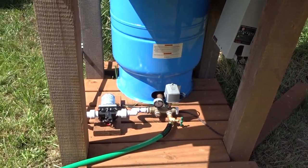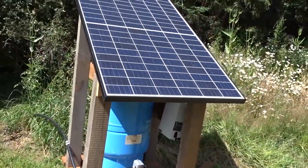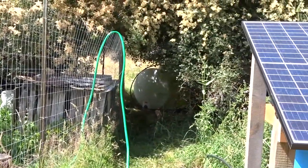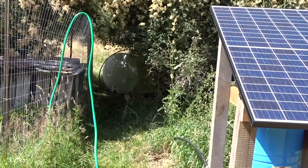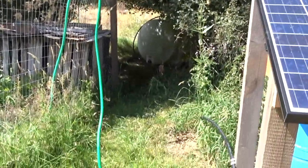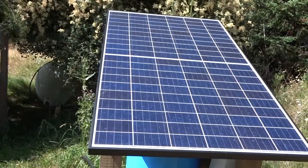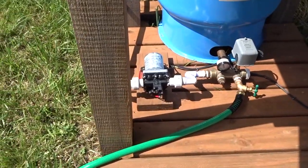I'm going to show you a solar pumping system that I recently built. It's out here to water a small garden on the other side of the fence using rainwater that's been captured over the winter and stored in big tanks. That's the first tank you can see there — there are several other tanks behind that one and some more up the hill at another house with a different roof. We have one REC 290-watt solar panel driving a SureFlo 12-volt pump.